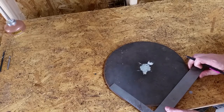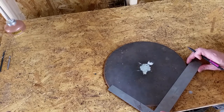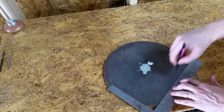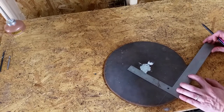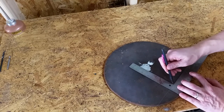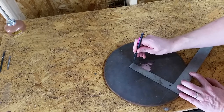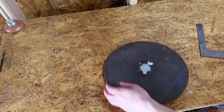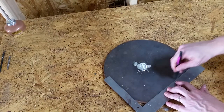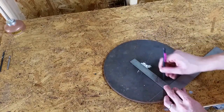Then I just beat it with a hammer until it fell off. I just happen to have this half-inch steel plate that'll be a perfect replacement for the old thinner plate. To find the center of a circle, draw a straight line on the outer edge, find the middle of that line and draw a perpendicular line. Spin the circle a bit and repeat the process at least once more. Wherever the lines cross is the center.